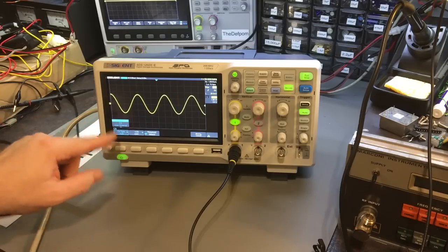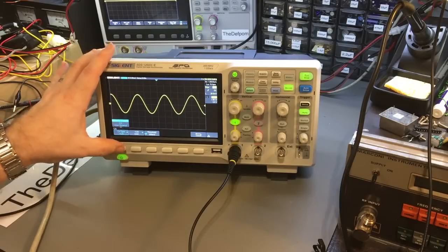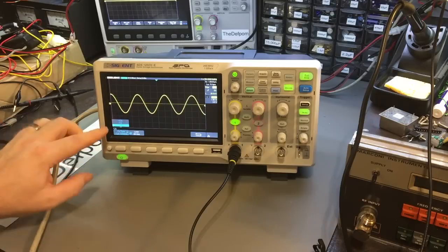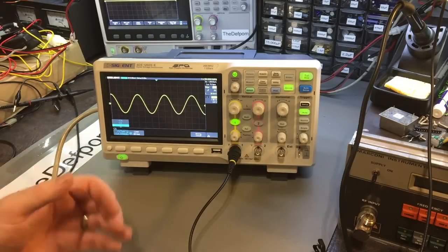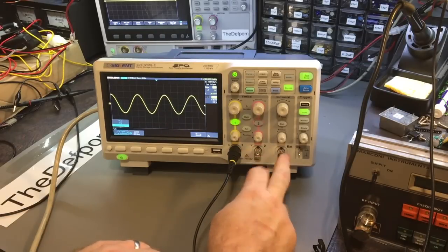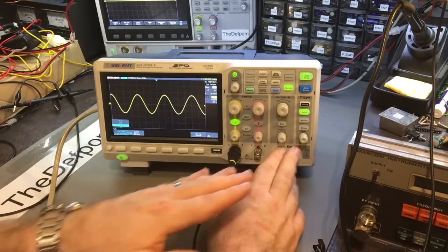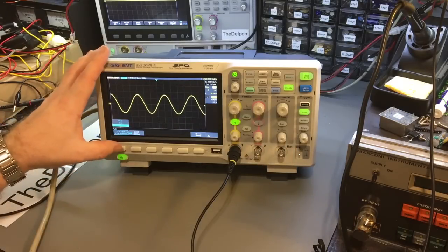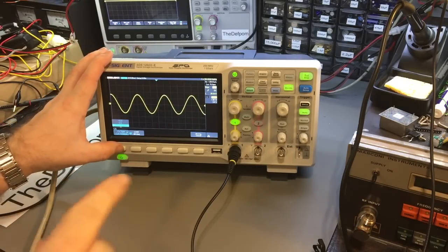This is a really handy feature on this. You've got chip select options there, and also which channel you're going to use, like 1 or 2. And you've got clock timeout. This one's really handy if you're just going to do it on timing. Because it's 2 channel, they might be able to use external. I'm not sure, I haven't looked into whether the external will act as a trigger for the chip select. I suspect not, because it didn't come up as an option.